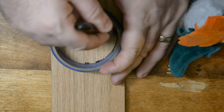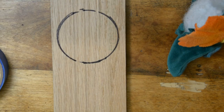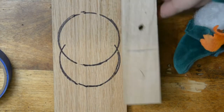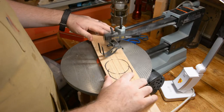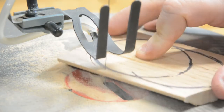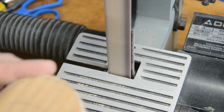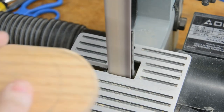The inside diameter of the blue painter's tape I use in my shop is exactly three inches, so I use that and a tape measure to make a three by four inch oval that'll go inside the open portion of the rooster. When I'm using my Delta 16 inch scroll saw, I try to make generalized cuts close to the line I've outlined, but not exactly on them. I find it way easier to go back to a sander — like this one inch belt sander — to get it down to the final dimensions, as opposed to obsessing over getting it exact with the scroll saw.